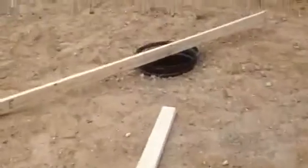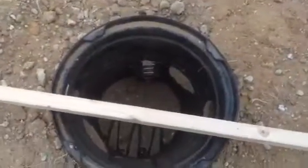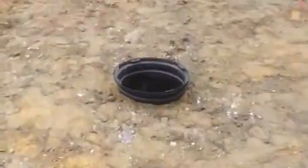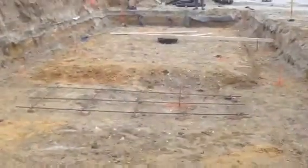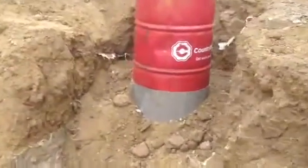We've got a couple sumps set in place. That 4-inch floor will then drain to these two sumps. That one's tied to the second one. And then this second sump has an inch fall from the first. And then this sump then has an inch fall to our little pump pit.